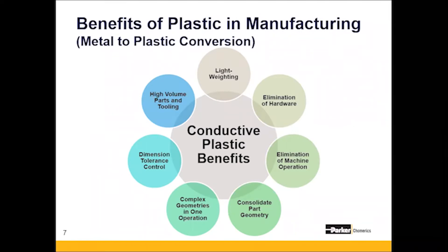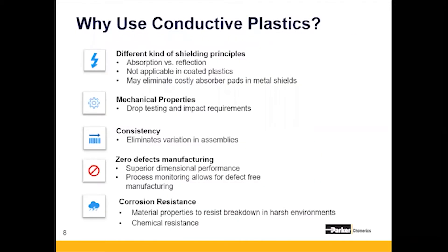While the tools for plastic parts may have an upfront cost, they're going to last nearly 10 times longer, yielding upwards of a million parts before scheduled maintenance, instead of tens of thousands with die cast. Not everyone will be designing parts in the millions — it might be in the thousands. You can get away with modern aluminum tooling with some hard coats for low-volume production in the thousands of parts.